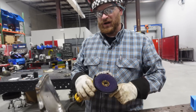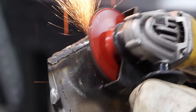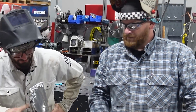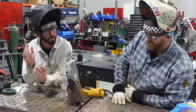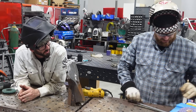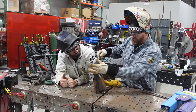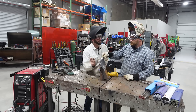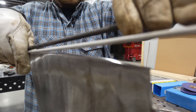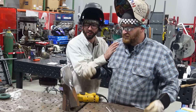All right, so we're done with the 7018. We're going to knock it all down with this 3M fiber disc and then we're going to stack it up — put our buttering layer on with the 309. You flat topped it good with that fiber disc — that thing is a gem. It hugs and just eats it. So why do we put the 309 and not just go straight to the hard facing rod? Our 7018 is stacked up hard, however it's not as strong as our stainless. The stainless is a good barrier between our parent material and our hard facing, so we don't rip apart the build up — otherwise it would break off and we'd have a spalling issue.